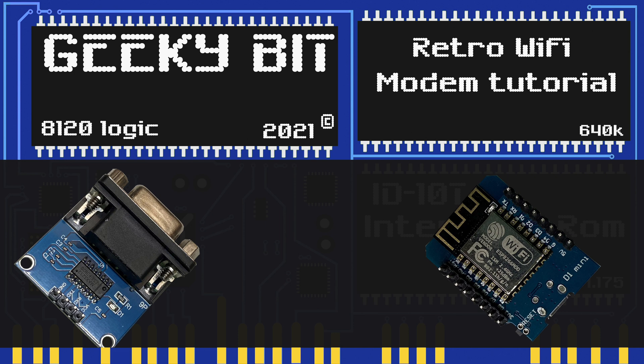This next part you can do either by soldering or using wires to attach to the pin headers. Let's talk about power first. The TTL device can take 3 volts or 5 volts, and the ESP device can put out 3 volts and 5 volts. However, 3 volts is what all the pins are compatible with, so we'll be using 3 volts. Take the 3V3 off the ESP device and hook it up to the VCC pin on the TTL device.